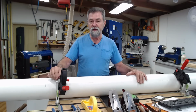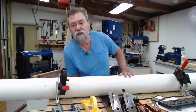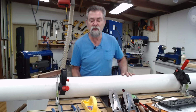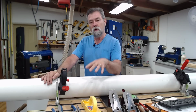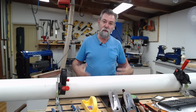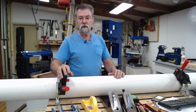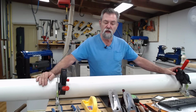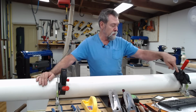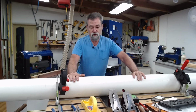Okay, now what I've got here, this is on my bench. I've got a couple of lever clamps through the dog holes in the Stanton bench. It's not secured to the bench below because the anti-slip grip tape on the legs and also along the back of the apron are going to stop it from going anywhere. I've got a couple of strap clamps anchored around the pipe, both ends, and also onto those lever clamps. And it makes it extremely stable.